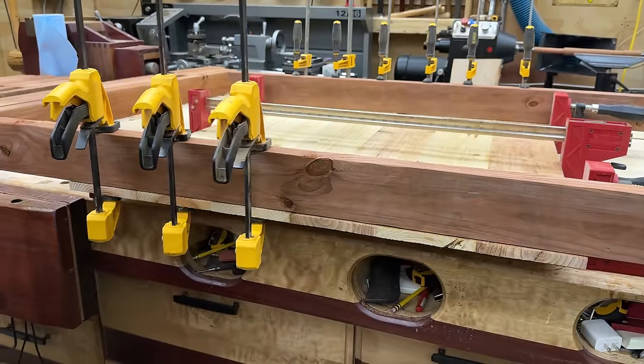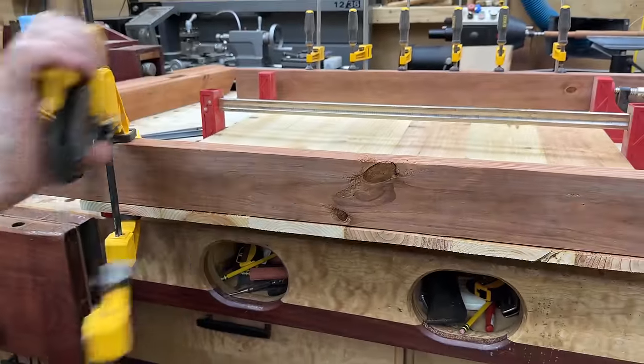Now it's time to unclamp the two different panels. I made two sets — one set made three fronts or backs, and the other set made the other three, since we have three planters total and need six fronts or backs. This is my wife Rupa, who usually films but occasionally helps with assembly. You can see I have tall ones and short ones now. The triangle shows why: the short panel matches up right to the edge of the triangle, while the tall one is needed because it has to be longer by the thickness of your picket so both the top and bottom line up flush.